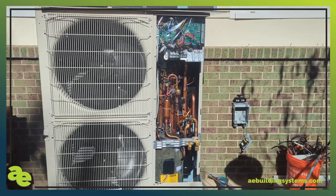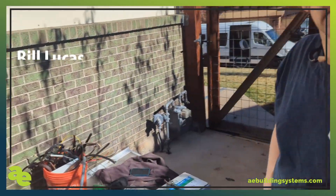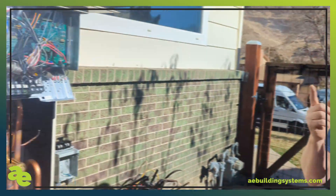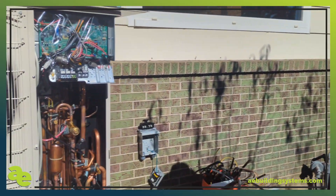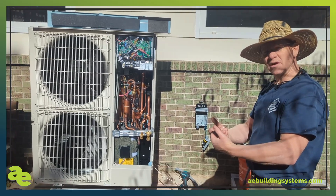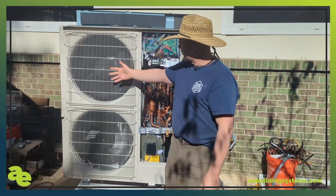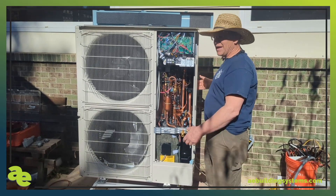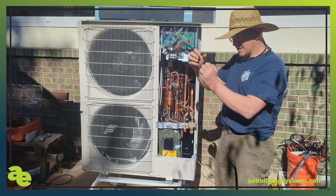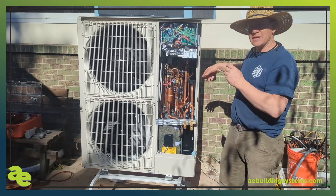This is the outdoor compressor. What does it do, Bill? It is the outdoor heat exchanger — it's the motor of the outdoor heat exchanger. It takes whatever air is outside, say 45-degree air, and if we're in heating mode it moves that air across a heat exchanger with a compressor. There's refrigerant running through the compressor, and in basic terms it makes the outside air a little bit colder — it's taking heat that already exists in the outside air and concentrating it into the refrigerant, then pushing it inside.